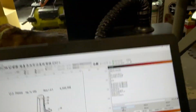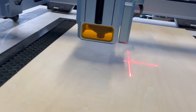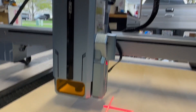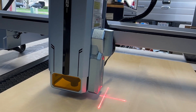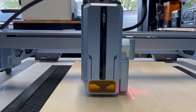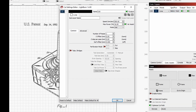Go ahead and place the material underneath, click on Auto-Focus, and look at that. I've done a dozen laser reviews, and this is the first gantry open laser that has auto-focus. Basically it has a limit switch underneath — it clicks down on the material, then raises to the appropriate focusing height. Now, since you have a motorized Z, you could do auto-syncing — what that does is, per pass, if you want to engrave deeper, you can set it to go deeper. For example, I'm going to set this to 0.5 millimeters, so after every pass the Z will drop down 0.5 millimeters. That's pretty cool.